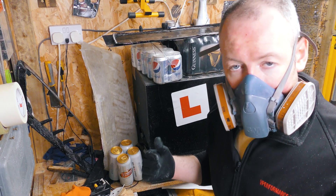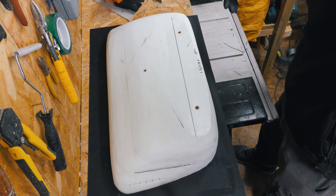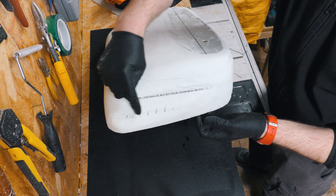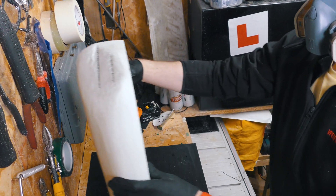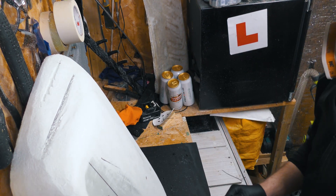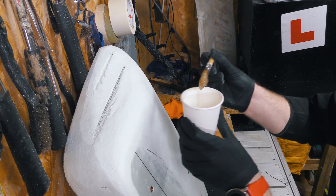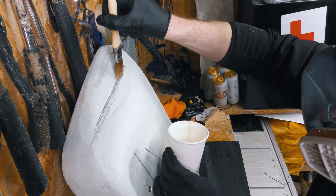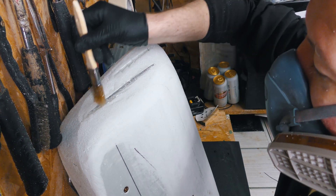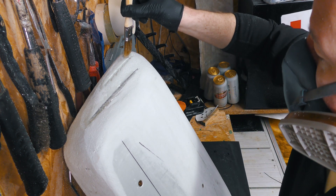I'm just going to whip up a batch. Right, you're up on the workbench now — I've got my plug down below me here. I'm just going to use some epoxy to fill in these gaps in the sides. I'm going to have to do both sides in two stages because of the way gravity works, but that's okay. I'll do this side now and the other side tomorrow. It'll just take a couple of layers but this whole thing is going to get sanded smooth.